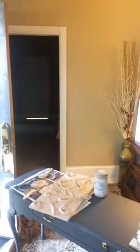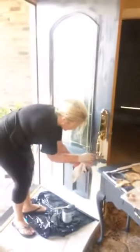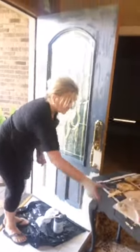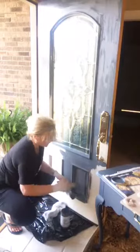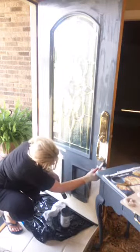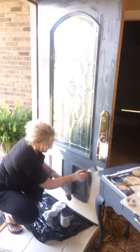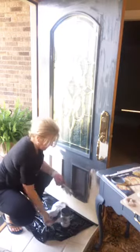Paul, we've got a lot of questions coming in. Can we do some questions? Absolutely. Ask away. Kelly Ann would like to know if this would work on a fiberglass door. Yes, it would. It sure would. Julie wants to know what prep is required. Does she need to sand, prime? You do not need to sand and prime. This paint comes with a built-in bonding primer. Now, it doesn't have a hide primer. If you're painting whites over something dark, you might consider using something for bleed.